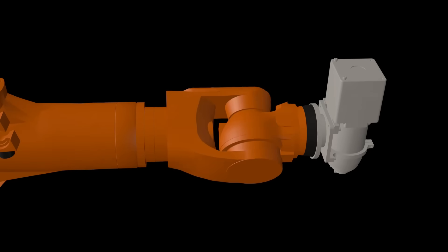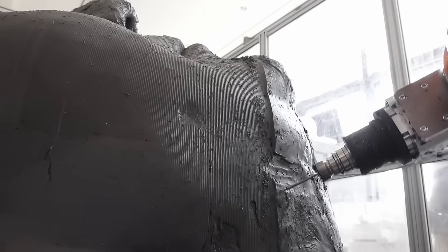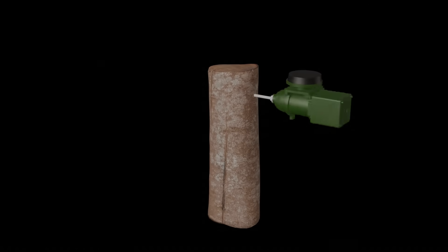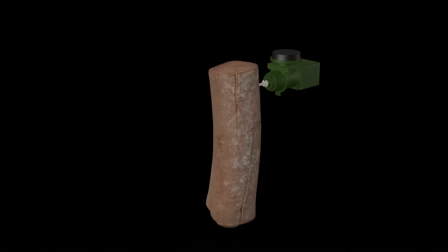We do have the option to change the shape of the tooling, or change the orientation we're machining at, or move the log. All of these seem like really easy solutions, and they would fix these particular problems, but they actually end up getting the robot into different problems later. Normally when you're doing large machining like this, you have something called a rotary table or a positioner in front of the robot — an extra axis that the robot can control and spin. I don't have a rotary table here, but instead of bringing the spindle over to the log, what if we keep the spindle stationary and have the robot pick up the log and bring it over? If we put the spindle in the right spot, that should give us a lot more flexibility for how the robot can move to actually cut it.